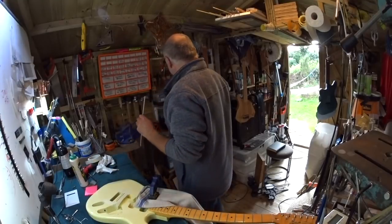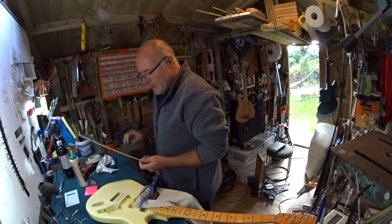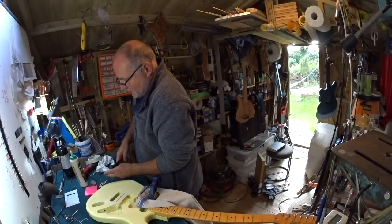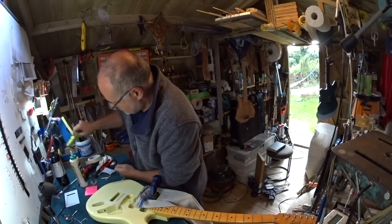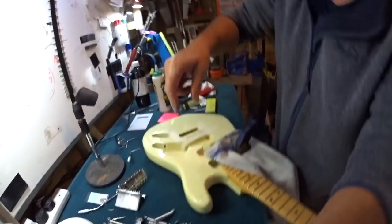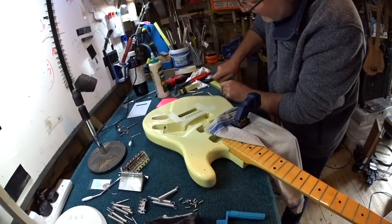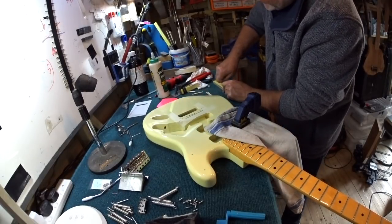Some of this, aka dowel. Nice, perfect fitting. We need 6 bits of it, so let's get 6 bits. Keep your fingers out of it, it usually helps. 5, 6. What began as a simple task becomes complicated. Like I said, could have got another, or waited, or ordered another bridge, but this is a decent enough way of doing it, particularly since there are already those cracks, which this will stabilise, because the glue and the wood will kind of lock the crack in the middle, which is quite useful.